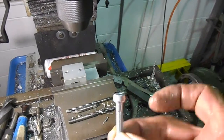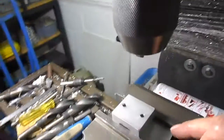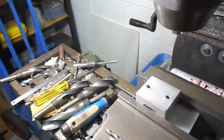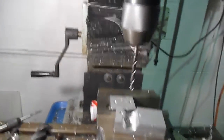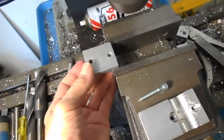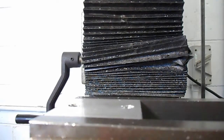We have to do a counterbore down in there so they sink down in there and look flush, neat — you know. And the thread down the bottom so that it bolts together. And here's where we put our pattern for the hook — the stainless steel hook that goes on the latch. That tube I put in there is the same size tube as what's on the mast. Some counterbores for the top — same size as the head.